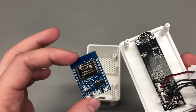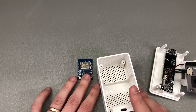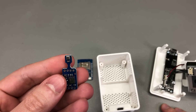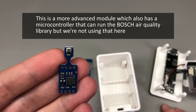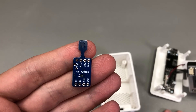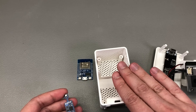This was my initial plan, but after thinking about it a little more — with all of this available space and available GPIOs on the module — it kind of makes sense to add another sensor. So I looked through my bag of sensors and found this Bosch BME680, which looked like a good candidate because it can measure relative humidity, barometric pressure, ambient temperature, gases and volatile organic compounds. I quite like the idea of having those extra measurements coming from the same unit.